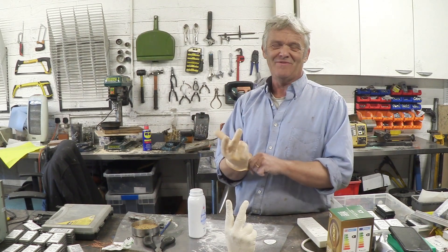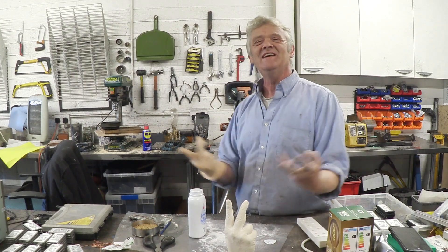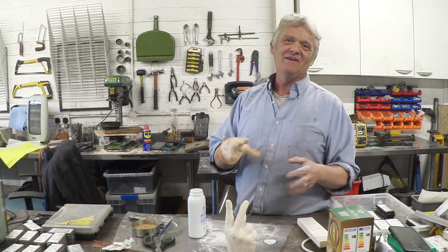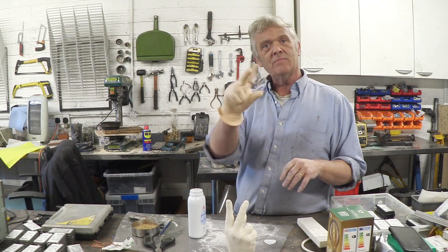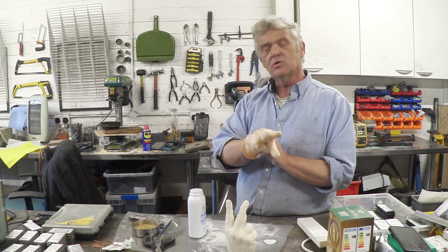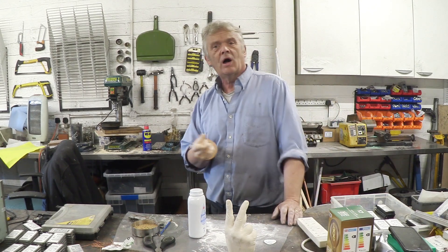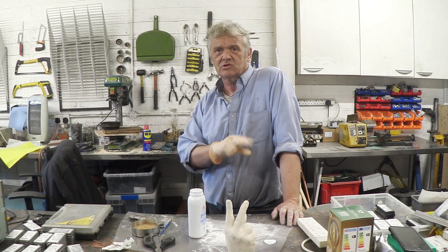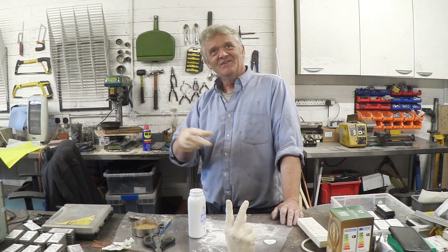You don't have to do body parts, but if you want individual fitting things for various body parts it's obviously a way to make those unique items. You can take a master of something into the alginate, make a plaster cast, then make a silicone mold — and remember this can be a mold that produces two, three, four hundred parts depending on how you do it. You could mold absolutely everything. We used plaster of Paris but you could use resin. Making gloves, molds, or parts this way is tremendously useful, especially if you want to make specialist stuff that fits perfectly to your dimensions.